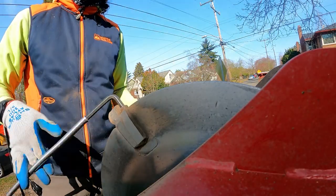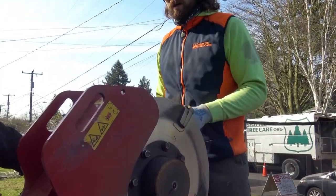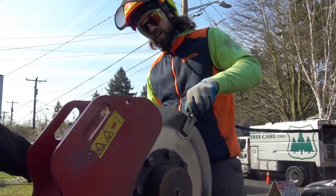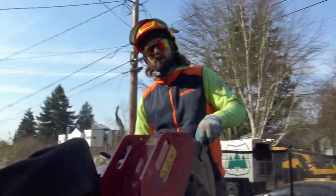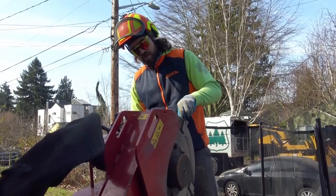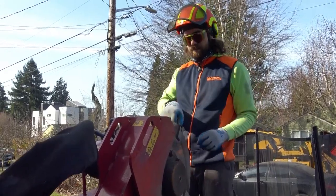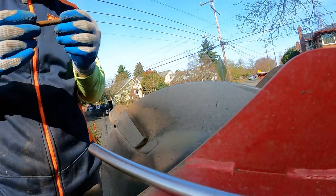I just did a little look-see. There are four teeth on here. One of them looks good, one looks okay, one looks bad, and one is broken. So we've got a nice mix of quality. Right now I'm just replacing this broken one — and by broken, I mean really badly dented and it's not cutting very well. You take out a bolt and then there's kind of a locking piece behind the cutter head.